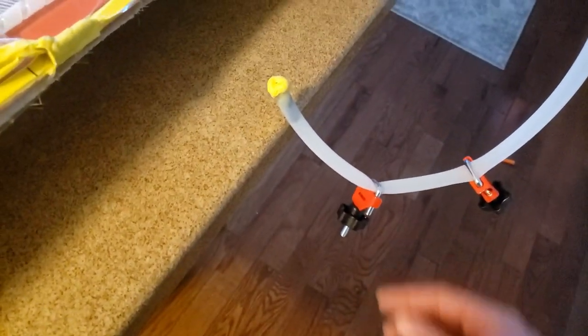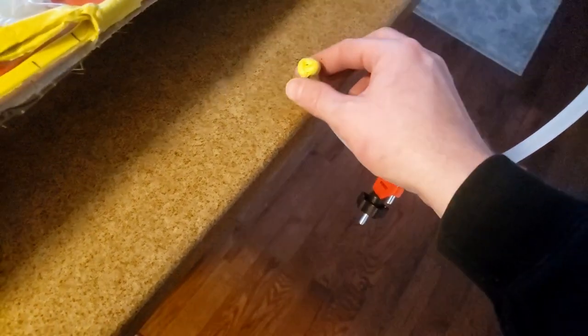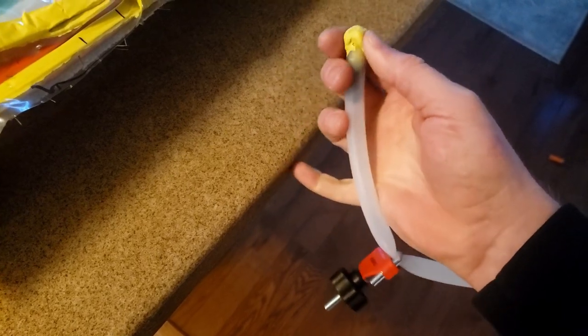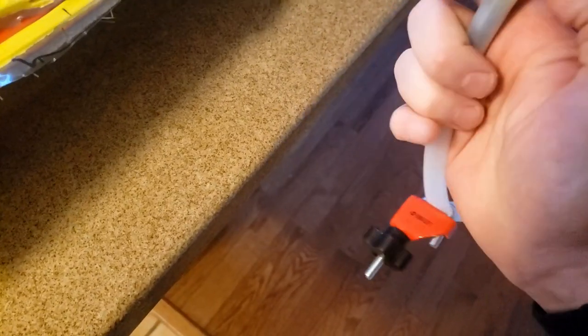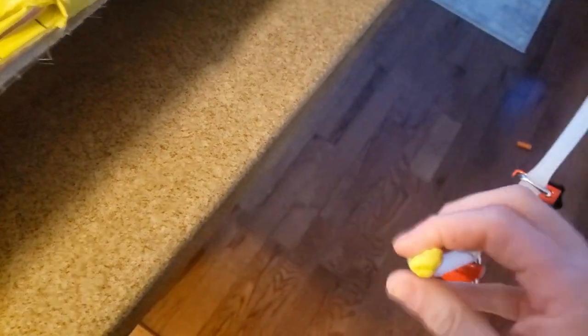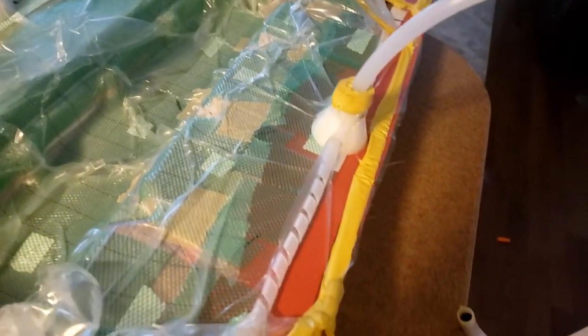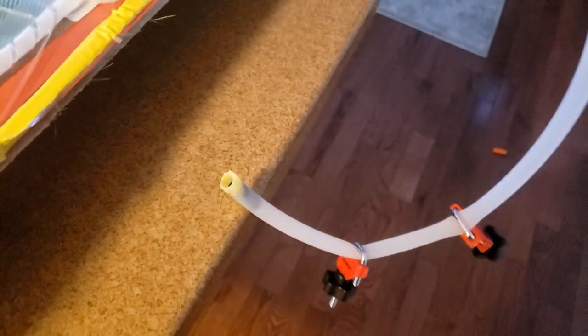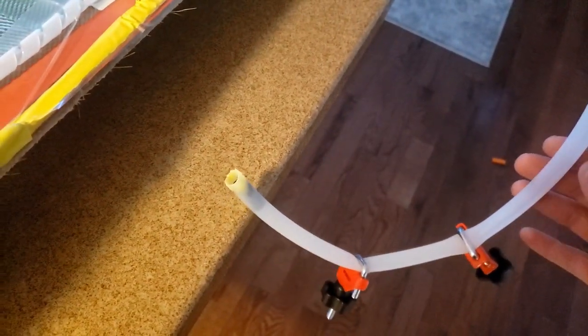So I'm not going to worry about the hole too much more because I'm pretty sure that even the valves that we have should be okay. And if it's leaking out, sucking in the resin pot slightly more, I'm not particularly concerned about that because I'm not worried about a super dry part. Now the fun part is I gotta cut this off to get my vacuum cap out, but that's not a big deal. So we're gonna go ahead, mix up some epoxy.